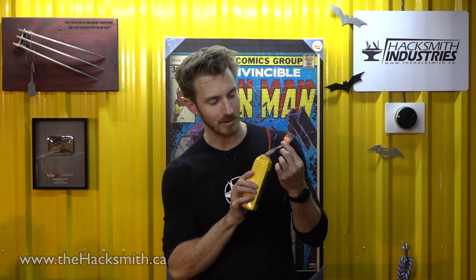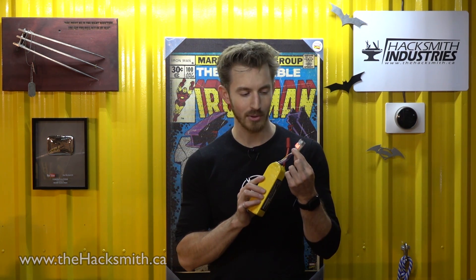Also, we're not going to be charging the batteries on me, so we're not really at risk of the batteries exploding just from being charged. But what happens if you discharge the battery too much? Well, the battery tends to puff up and there is a chance it could explode. Luckily, we have these little battery alarms, which are plugged into the cell balancing port of the lithium polymer battery. They constantly measure the voltage of each individual cell, and if any one of those cells drops below the safe range, it'll start beeping really loudly telling us to stop draining the battery immediately.